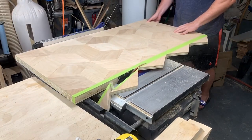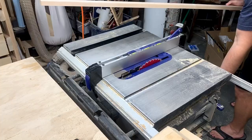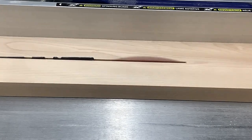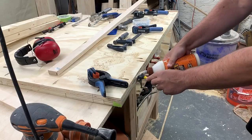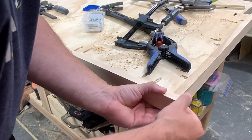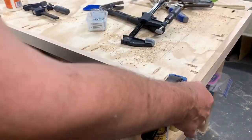For the last edge I just ran it through the table saw. For the edge of the table I ripped a 1x4 piece of maple in half, which made the edge slightly thicker than the table edge to hide the hairpin leg bases. After that I glued and screwed the edge using pocket holes and a lot of different clamping methods to make sure everything lined up correctly.